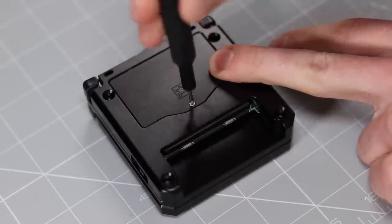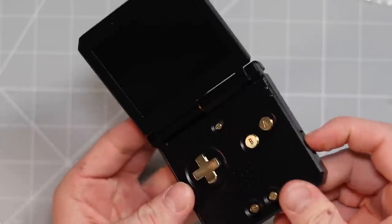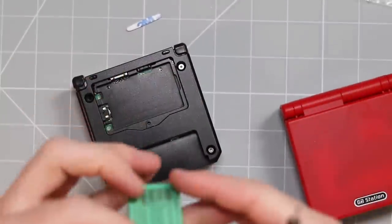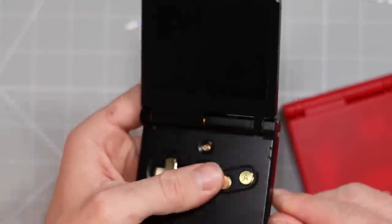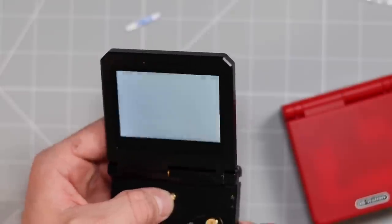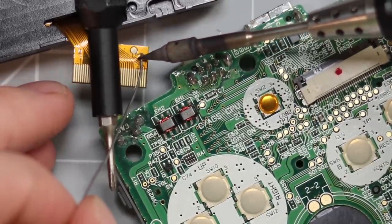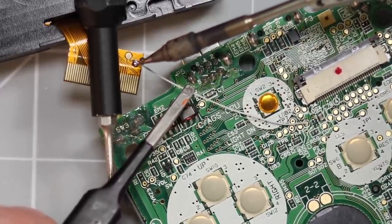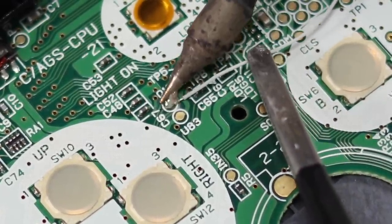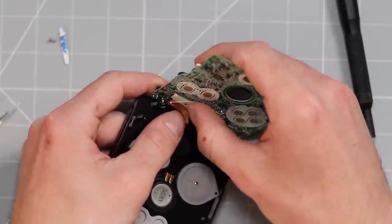This tiny little screw is going to finish basically the entire thing off. Obviously I need to go and find that hex screw. Does it actually work? Let's find out. No, it doesn't. Fake AliExpress Game Boy to the rescue — is it the battery that's the problem? We're discovering a few problems here. I'm assuming maybe I needed to solder a wire. So let's solder this wire into place. This is still a solderless mod — you don't actually have to use this screen. You could use an AGS-101 screen or even an AGS-001 screen if you wanted that front-lit option. That wire then has to go to this pad right here — Q128. The brightness is now working. That's what we wanted.